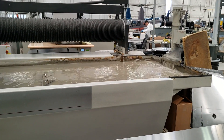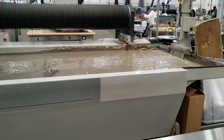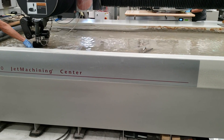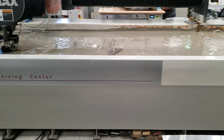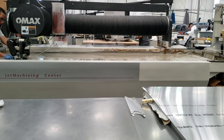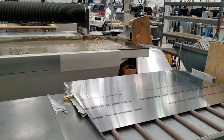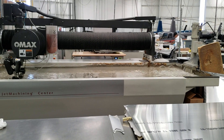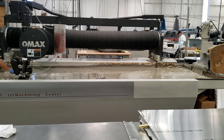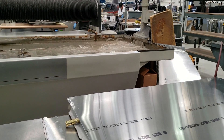What the water jet cutter does is it fills up with water and sand, making the water abrasive. There's a high pressure nozzle underneath, and it's just high water pressure that does all the cutting. You can take eight to ten sheets of aluminum at one time and cut out and trace various shapes. Once the process is done, the water gets filtered, the metal pieces go into a bin, and then the water comes right back in and gets filled up with sand again.